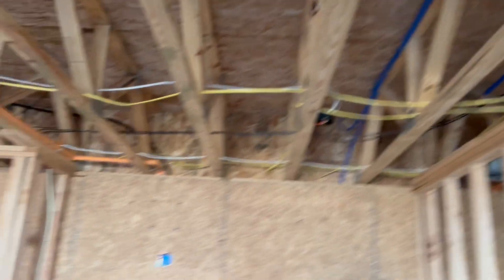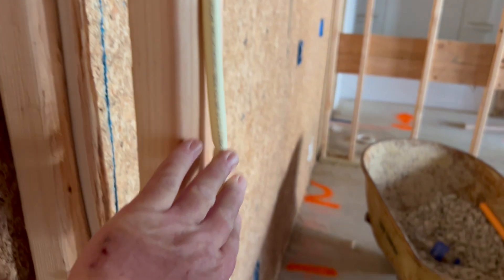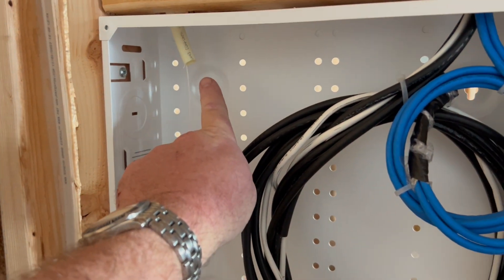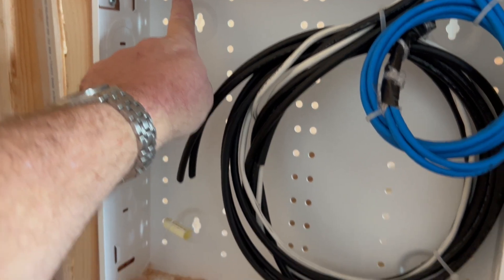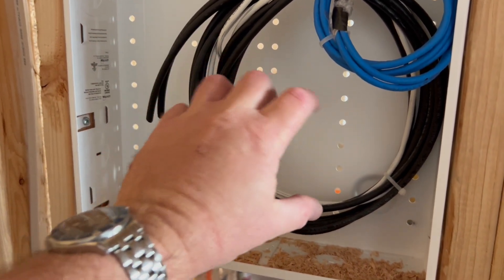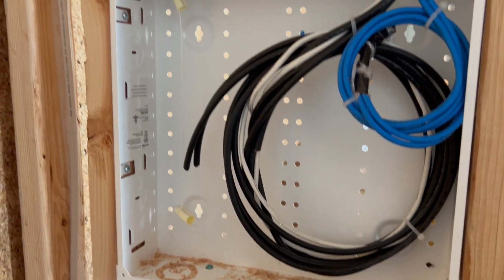You want to make sure everything's high and tight. A lot of times with apartment complexes and townhouses they'll have this pipe, and in here will be our enclosure. This is called a micro duct — what we'll do is later pull fiber in there. They'll have their device in here with all our cable terminations, so a lot of times apartment complexes will just have the coaxial and TV in this particular device.